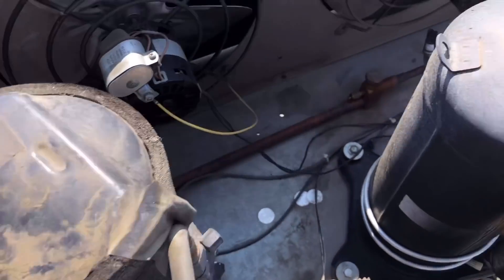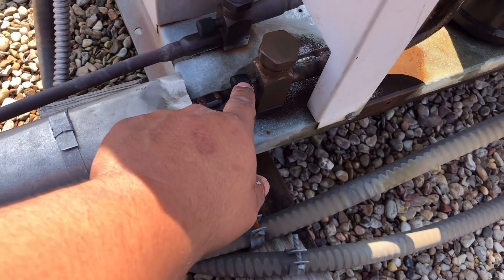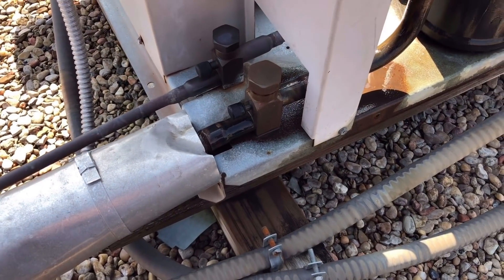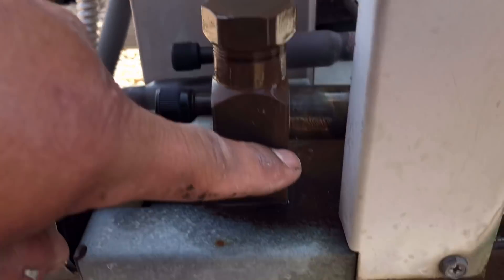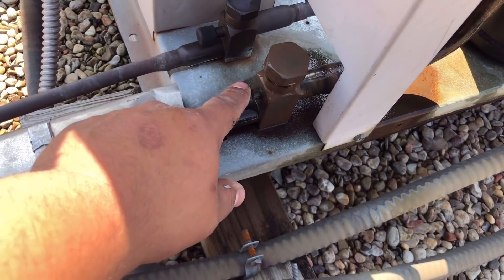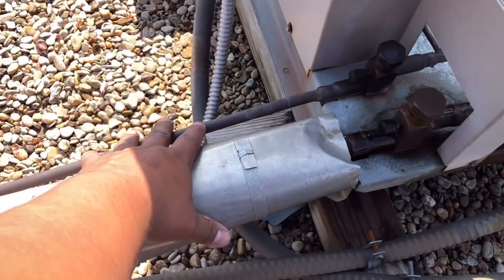That is the plan. I might recover from there — this doesn't have a tab — possibly recover from here. I always complain about these valves because if you front-seat this valve it's going to block flow from here and you're going to be tapped into the condenser side. Whenever we want to do a vacuum on just the evaporator, you can't do it from here because you're going to suck in from this side, not from this side. Anyway, we're going to have to trap as much refrigerant as we can on this side.